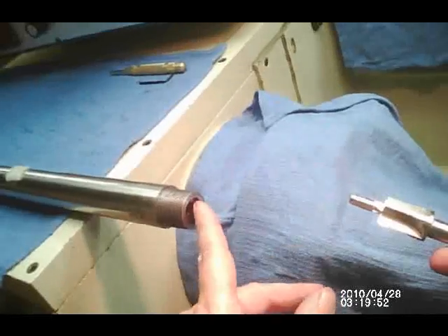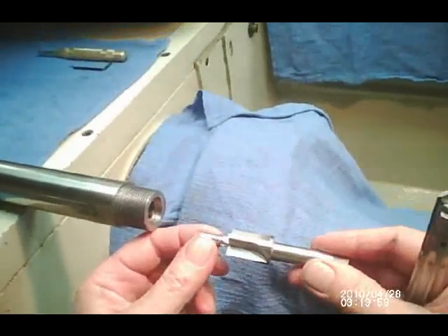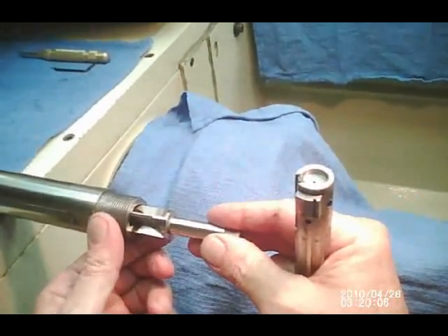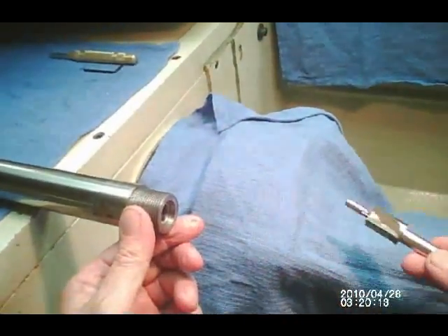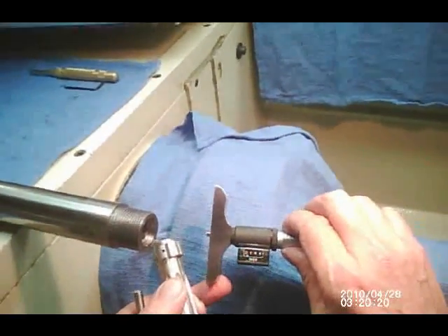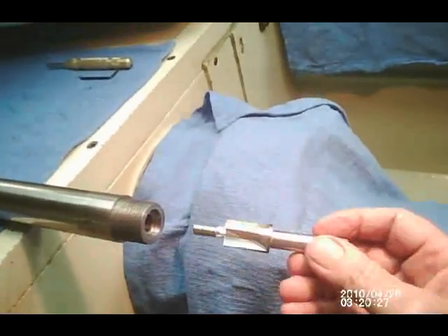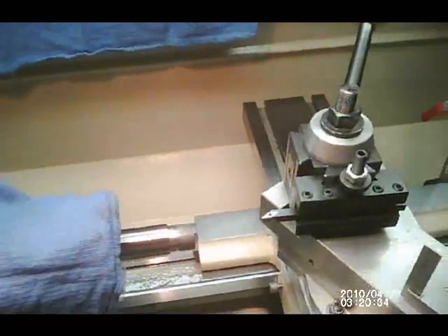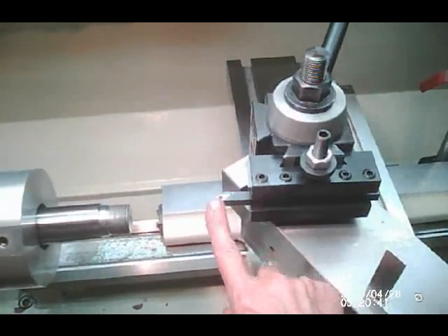This reamer has already been chambered so the hole is large, but normally you'd put the appropriate bushing on the end and feed it in to 145 or 150 thousandths as needed. On the barrel we're doing right now the measurement is 144 thousandths. The other way to cut this recess without a specialized reamer is to single-point it, and today we're using the Arthur R. Warner profiling tool with a 35-degree diamond insert — a very sharp high-speed steel insert.